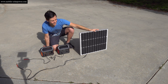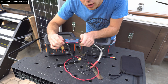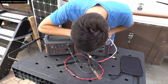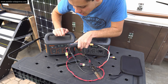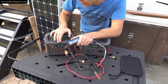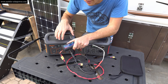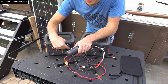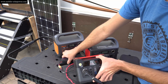Now we're putting a watt meter between the two Jackeries. There's 41 watts going through the watt meter, 44 watts coming out of the first unit, and 42 watts going into the second. So the losses are in the first Jackery. Interestingly, it's outputting 13.15 volts — I expected 12.6 given its state of charge. I'm guessing it has a converter on the battery and the shunt is attached to the battery itself, so we're calculating losses between the battery and the converter output.